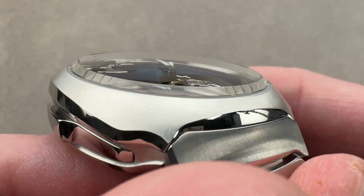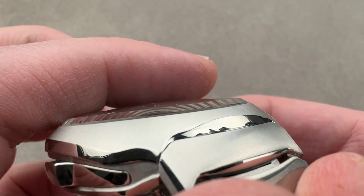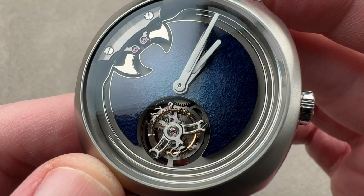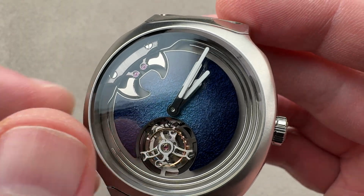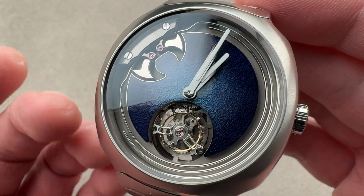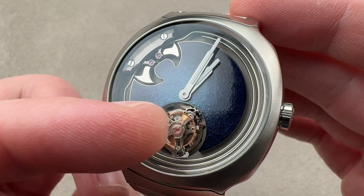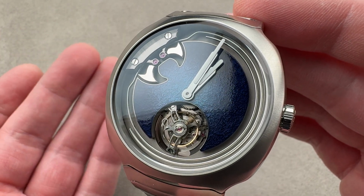Now, the fascinating thing about this crystal is that it is both boxed and cambered. So you've got doming across the top, and then you have this sharp angular boxed profile outboard. It's an unusual look. The dial is fired up to 12 times, and 3 different pigments are used to create this aqua blue fade from light to dark. Now, fumé or smoked dials are a signature of Moser, so this looks right at home. And uncalibrated or concept dials that feature no printing, no indices, no hash marks, no Swiss origin notation.